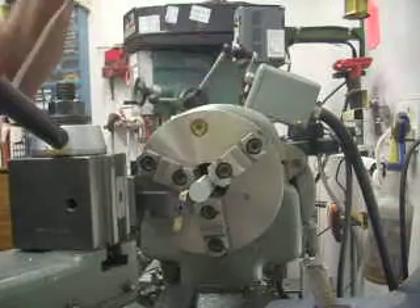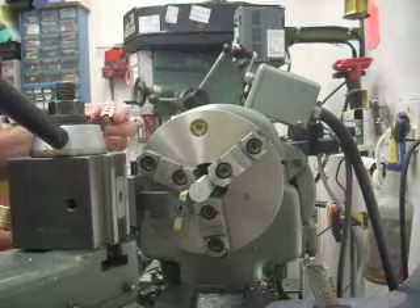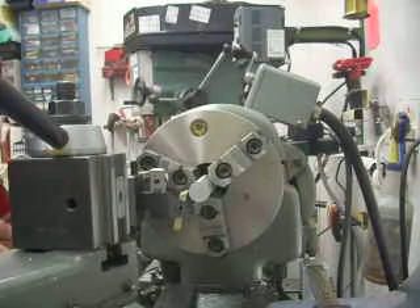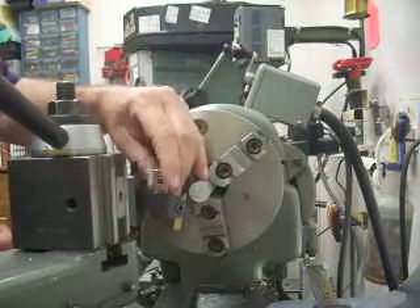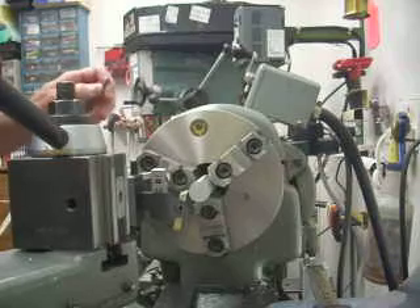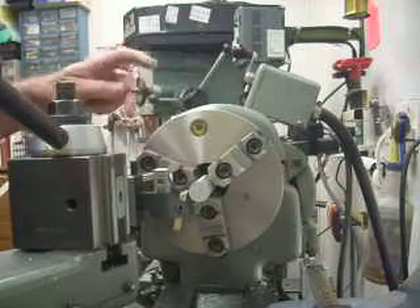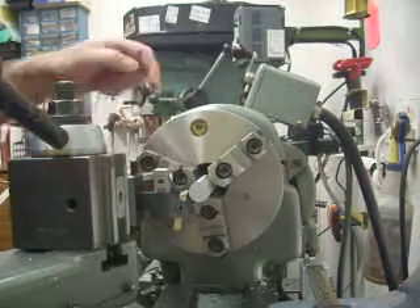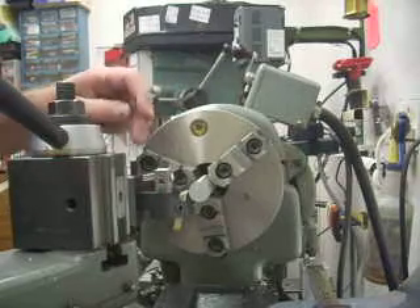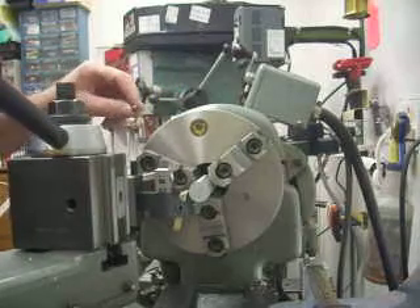Here is my improved electronic edge finder that has a threshold of about, nominally, 2.06 ohms. And this is my new combination indicator and electrical contact. It's magnetic. The top light is a super bright white, the bottom one is red. It has a curved bottom with a magnet, and it's meant to connect up over the compound dial or the cross-feed dial. I get a nice bright white light when I'm turning the dial, and then it turns red when I arrive at the touchdown.